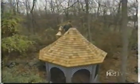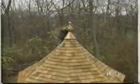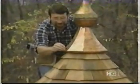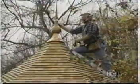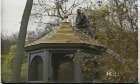All right. Now, this is going to fit right over the top of the shingles. And we'll get it plumb. And I'm going to secure it with some brass screws and some rubber washers to keep the water out. Well, how's it look? Pretty good? Well, now that you know how it's done, I hope that you'll build one.